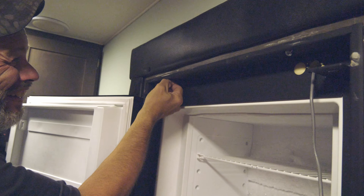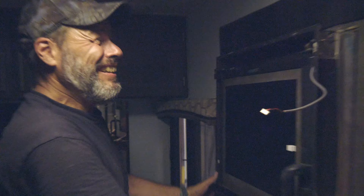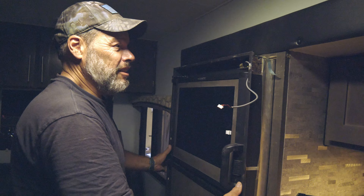We're going to a 12-volt setup, so the previous wiring won't be applicable anymore. Disconnecting the AC power — there's a plug-in right there — and then disconnecting the DC power with just two screws. Make sure you pull the fuse first, otherwise you get a little sparkage. The other screw is underneath this tape here, and now I'm just pulling it out. It just kind of wiggles out.